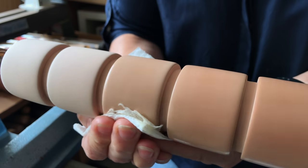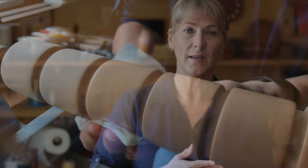A lot of the U-Beaut products are friction polishes, which means they're going to require friction to harden. When you apply the product to the rag you need to wipe it on the piece, and when the lathe is turned on you need to make sure that you don't stop moving. Constant heavy pressure will create friction, and that friction will create heat — that's a good thing. That heating-up process is what's going to set the polish and harden it.